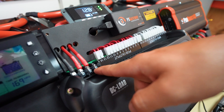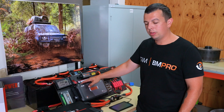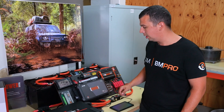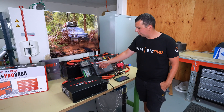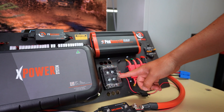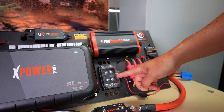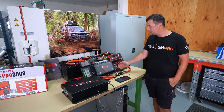It also has a 40 amp uncontrolled circuit so that you can power slightly higher loads through the distribution box, still keeping it all in a central location. If 14 output circuits isn't enough for your particular requirements, the 40 amp additional uncontrolled output can be wired into an additional fuse block like shown here on our panel hub system that we've pre-done.